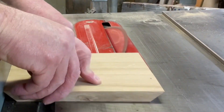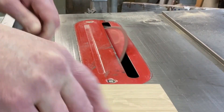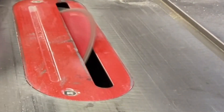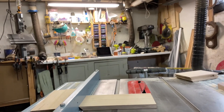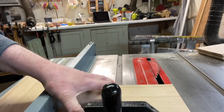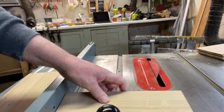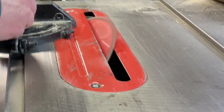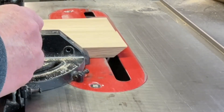When I recut the miters, you'll see how the saw blade actually comes up through the top — that's really important. On my test fit I didn't have it completely cut all the way, so the edges weren't exactly sharp enough. For the long pieces I did the exact same thing: tested, wasn't happy, readjusted the fence over just a little bit, and used my miter gauge to push it all through to make it easier.